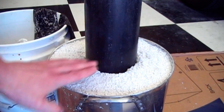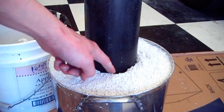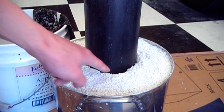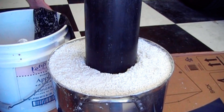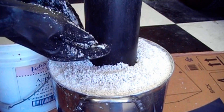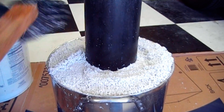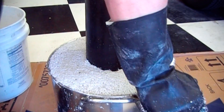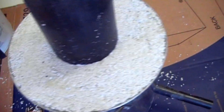I've placed my center form back in and I'm going to finish up the top. I found this area right here at the corner of the refractory is kind of a problem area — it'll tend to want to break up and pull up as you remove the form. So once I finish up the top, I'm going to leave this form in here until it's totally dry. There's the top all done; all that's left to do now is wait for that to dry.